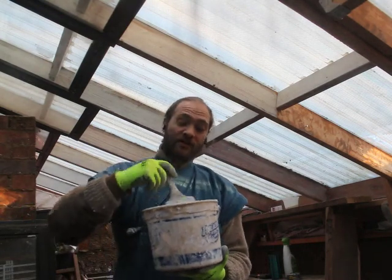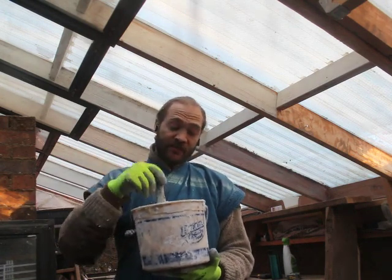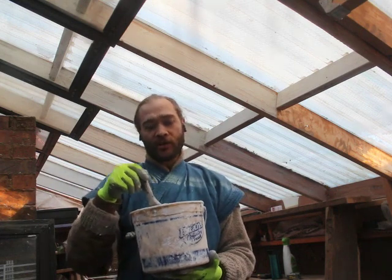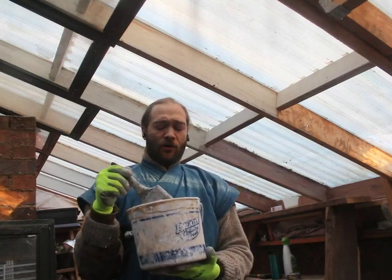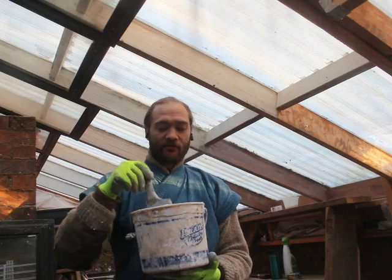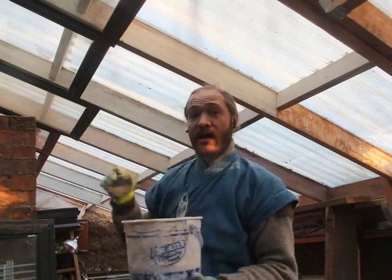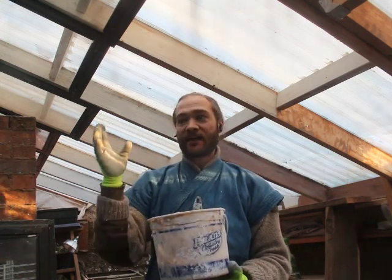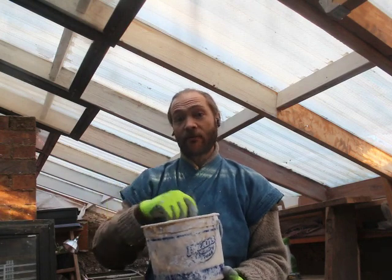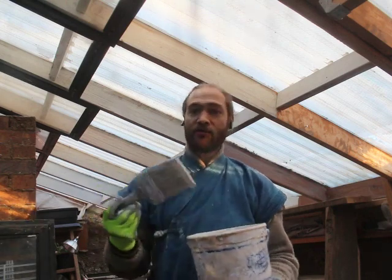Now it's time to do some whitewash — and whitewash is not just white paint. Whitewash is actually lime putty with water and a little bit of salt. I added a little bit of powdered milk because the casein in milk actually makes a more durable finish on wood. I've got about one part lime putty to four to six parts water, about an eighth part salt, and a small amount of milk. I'm putting this on the walls, already on the second coat in some areas. The nice thing about lime wash is that when it dries it crystallizes, has facets, and bounces light everywhere, making a much brighter interior than paint would. It also comes right off the clothing, which is nice.